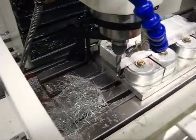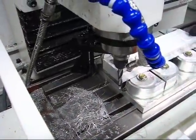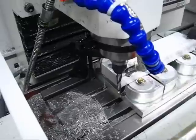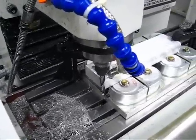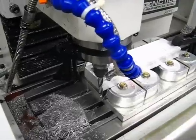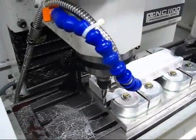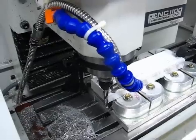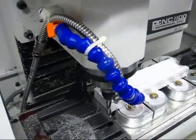I decided not to do G-code, but instead just punch in parameters manually to see what happened — width of cut, depth of cut, etc. — to get a feel for what I'm going to be able to do to avoid the chatter problems that were so extreme. I'll punch in some numbers and see what happens. I'm going to set up the next cut and go for it. We'll use coolant and spindle set manually and see what happens from there.